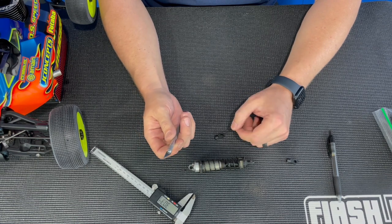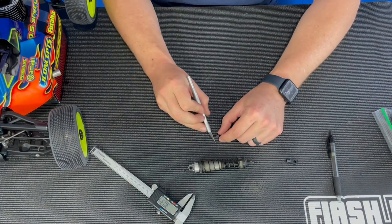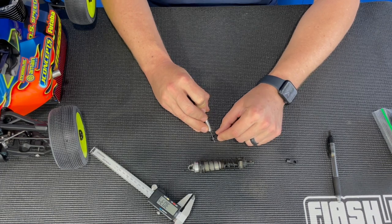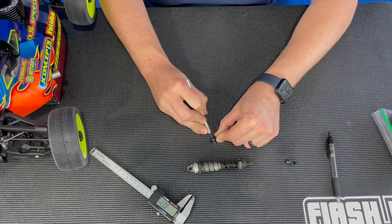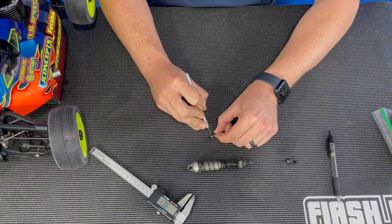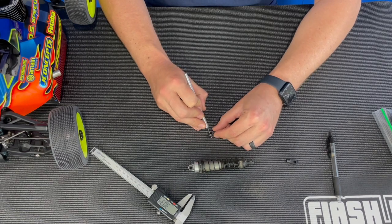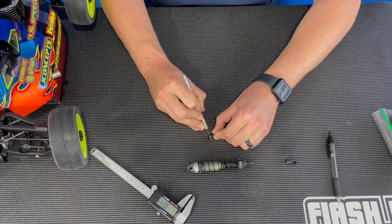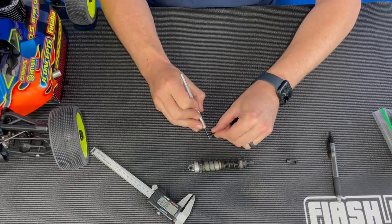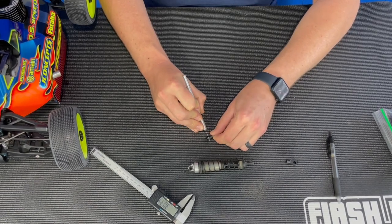It may even be better if you use more of a carpet knife, so you have a little bit more leverage. But I always start out just by finding that scribe, and then I'll just take the X-Acto. I'm not trying to actually cut all the way through yet. I'm just trying to score and scribe a line all the way around before I actually try to cut all the way through.